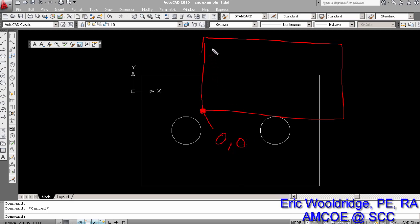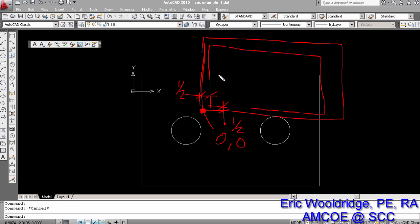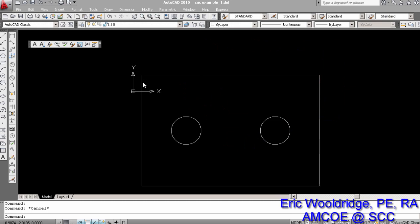So obviously you can't start cutting your object right on the edge. You have to give yourself a little space from the edge for it to have enough clearance to cut from. So you'll have a burnout if you try to cut right on the edge. So we typically recommend using about a ½ inch from the actual sides to place your object. So with that in mind, I have to figure out how to get my object here within a ½ inch of that, and that's actually done really easily.